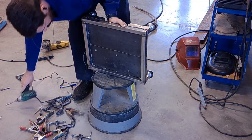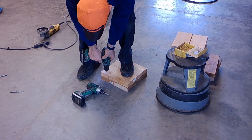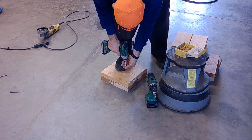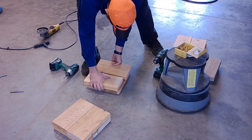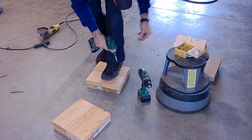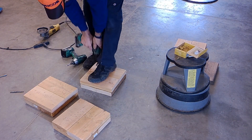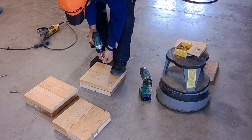I'm mounting the little junction box with some seven-millimeter screws and U-bolts. Because that raises whatever you're weighing about three and a half inches above the ground, I'm using two-by-six boards screwed together to make three separate pads. These three pads go under the three tires that aren't being weighed at that time. If you just jacked the car up and lowered it down, the car would be at a goofy angle and you'd get a weird reading, so this made the most sense.